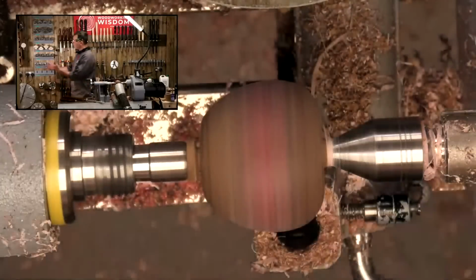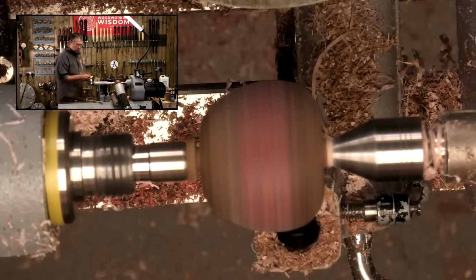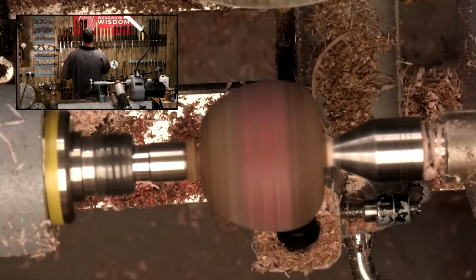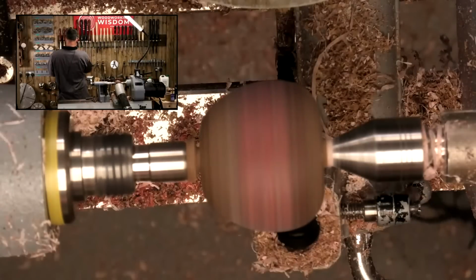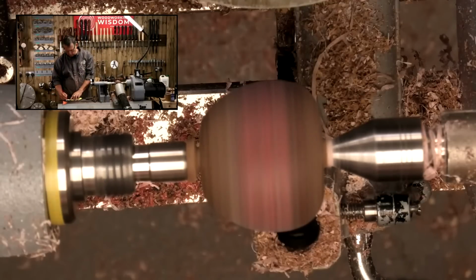So let's go. I'm going to start with a 150 grit, then a 240, then a 400. And because it's a little bit of resin in there, we're then going to go 600 as well. Let's get rid of these tools a minute. I need to mark my abrasive, so 240. That's actually a 400. And a 150 I've already got here somewhere. There we are.